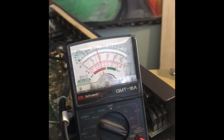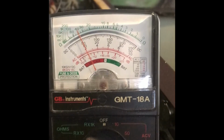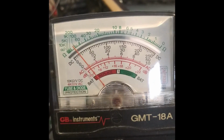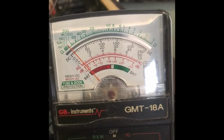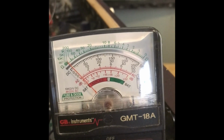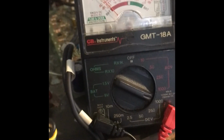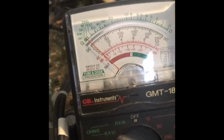If you take your amp and put it into standby, this is what happens to the voltage on the plates. Now, does that mean that the capacitors are drained? I just assume in my head, without looking at the schematic real quick, that that's what that means. So are you safe? Have you safely discharged your capacitors just by leaving your amp in standby?